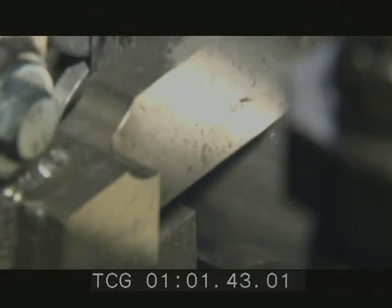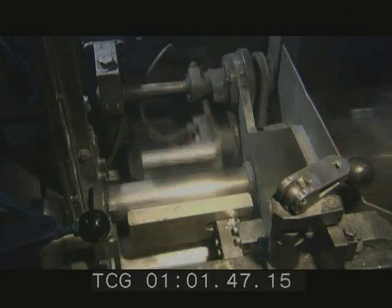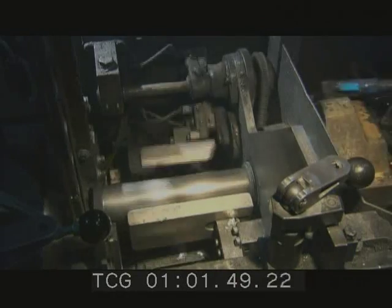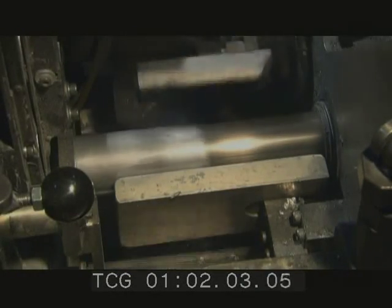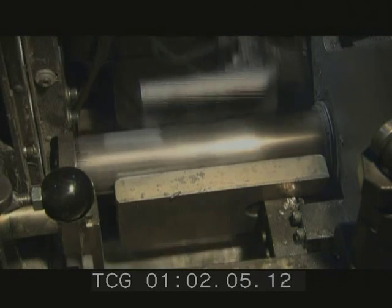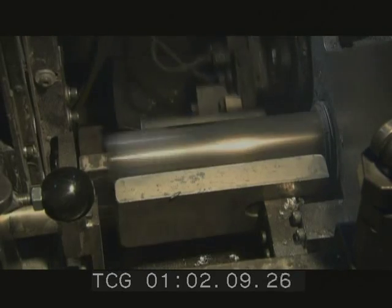A machine called an impact extrusion press does the stretching, by punching each disc with a cylindrical ram that hits it with 450 tons of pressure. The impact forces the aluminum to stretch itself up and around the cylinder to form a tall can. The machine can't work at a slower speed, so here's a look at it in slow motion, so you can see how the powerful impact forces the aluminum to wrap and stretch around the ram.